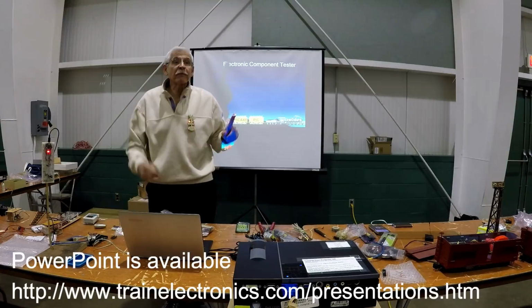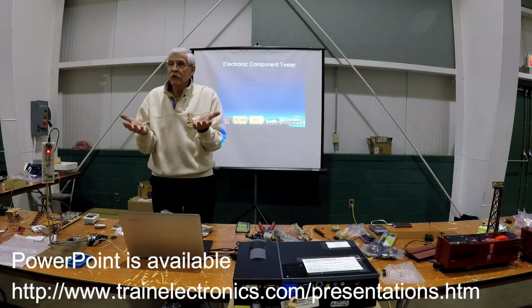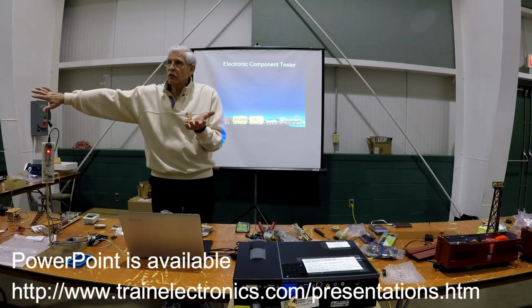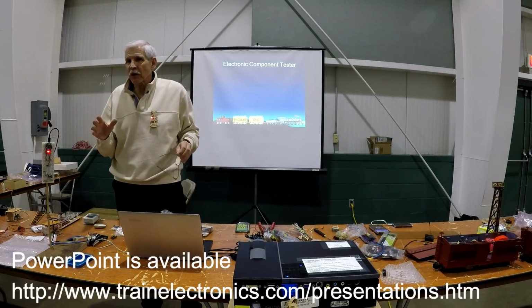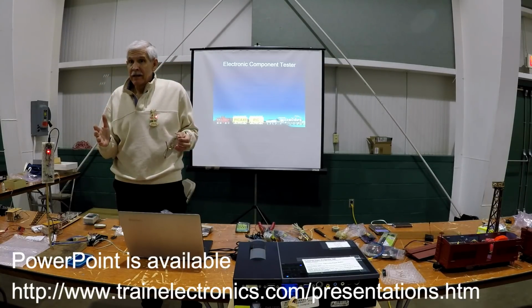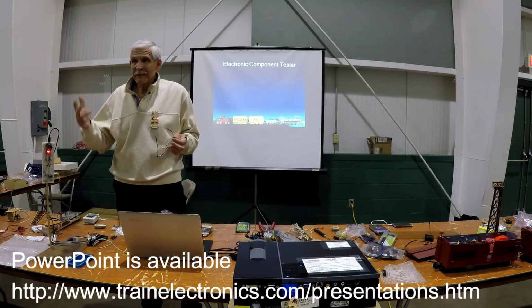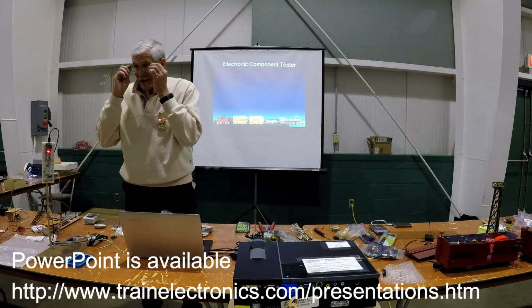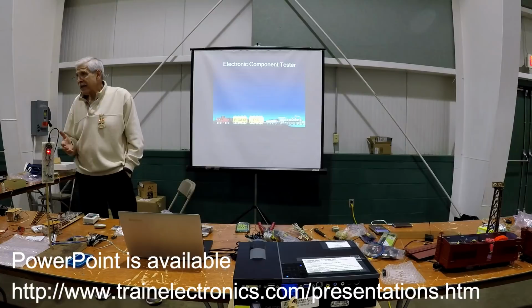Okay, questions up to there. If I had the choice between laser cutter and 3D printer, no debate at all. 3D printers go away. Laser cutter. I can have the laser cutter functional in a minute, and I can have a job done in anywhere from 30 seconds to 10 minutes. 3D printer, you got to level the bed. You got to make sure the filament's okay. You got, I mean. Yeah. And the detail you want may or may not come up.